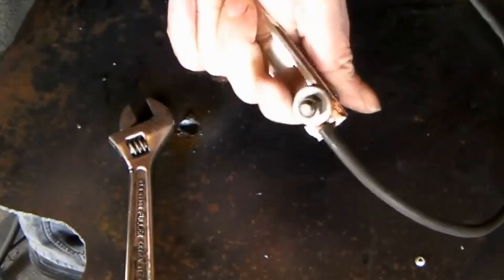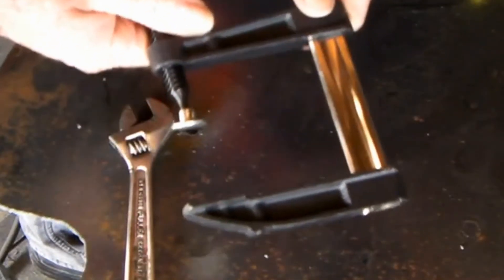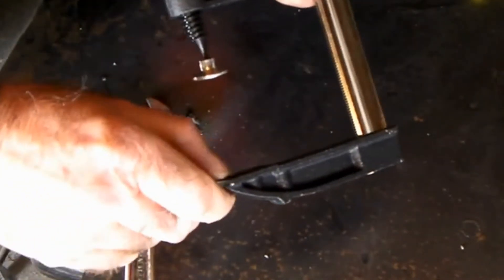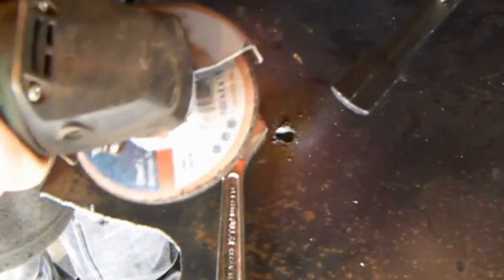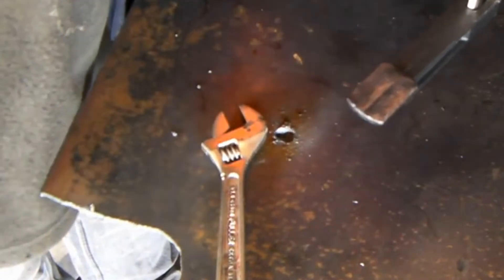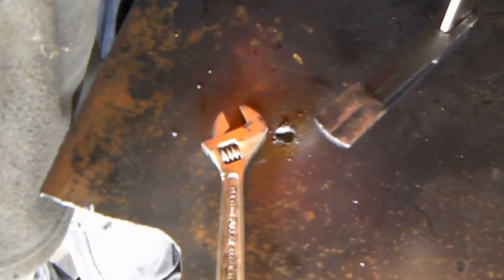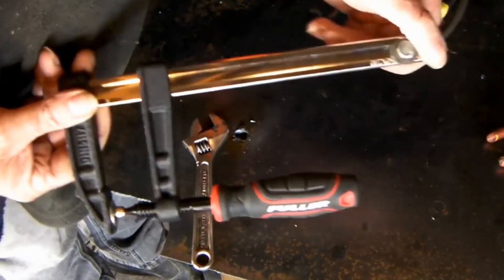That looks pretty reasonable — you've got the wire coming off the bottom of the clamp. One more thing I advise you to do: if you've got a new clamp like this, just get the angle grinder and take a little bit off here, just take the paint off it so that you've got a good contact. Don't go crazy with it, just take the paint off. After you've used it a couple of times you won't need to do that anyway because it'll just scratch it off automatically. So what do you reckon, guys? Doesn't look too bad at all — not too shabby for a boy.